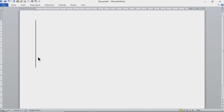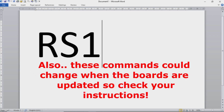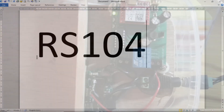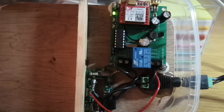This is the text message you send to turn your heater on or off. You always send RS, then channel 1 - that's the channel number. If you've got two buttons, unlike the old style rotary, you might have a 2 there - one for on, two for off. Then you put in the number of seconds you effectively want to put your finger on that button for, and it's going to be in two digits. So if it's a quick push to turn it on, you might say 01. If you've got a single button controller with a long push to turn it off, you might say 04. One very important thing - it is case sensitive. You must do this in uppercase. If you send lowercase letters, it will not respond.